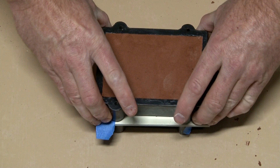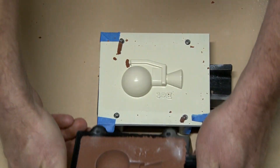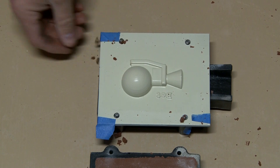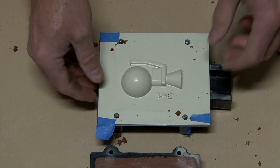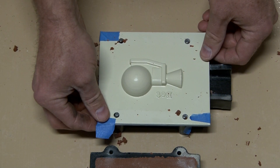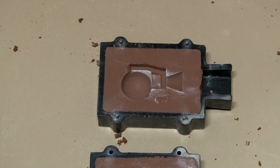Now I'm going to remove the match plates and reassemble the mold after I cut out the pouring spout. There's a little bit of sand left underneath the grenade handle — seemed to have a little tear-out — but that's fine, we'll take care of that with a burr set on a Dremel. I had to tap the match plates; they really stuck in the other side. Same thing on that side too — a little bit of sand tore out right below the handle.